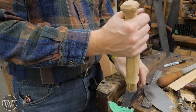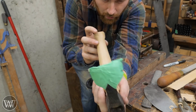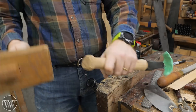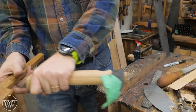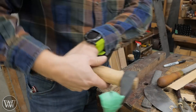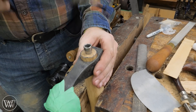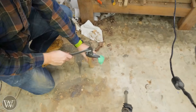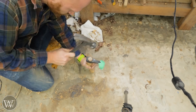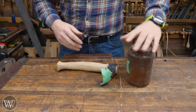So now we can actually hang the head and get in there. A nice, tight fit requires a good bit of pounding - drive it down in. We want to make sure that it is straight. In this case, it wasn't quite straight, so a few taps to turn it slightly because the head isn't elongated - it's ever so slightly round. You tap the heel and that will drive the head on all the way down to the shoulder. And there you have it - it is hung. Now we want to put in a wedge. I had this round wedge; normally I split it and put in a straight wedge both ways, but this round wedge actually works really well. So I set it down on there, tap it down in, and there you go - we have a head that will not come off.